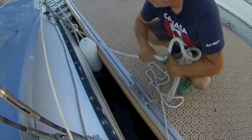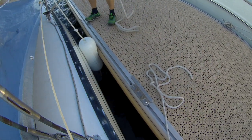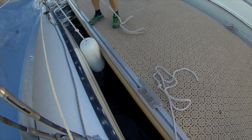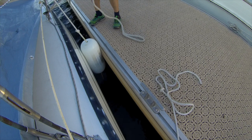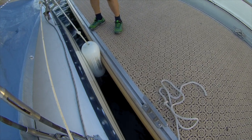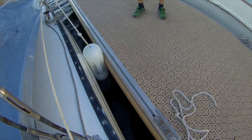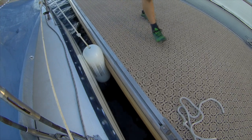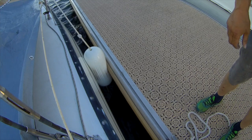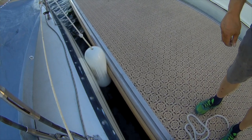Just doing a voiceover here while I was fixing the lines. I ultimately had three problems as stated in this video. I had a hole in my boat — a hairline crack — which I ended up putting multiple layers of fiberglass on, then Interlux 2000E barrier coat, and anti-fouling on top of that. That one was good. With the motor there were two actual problems.